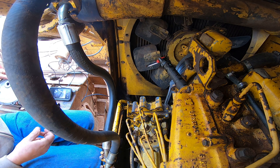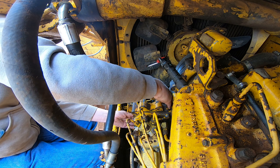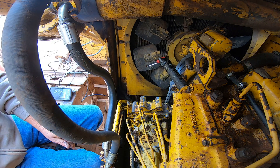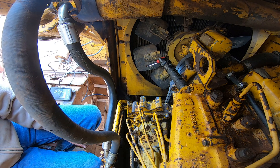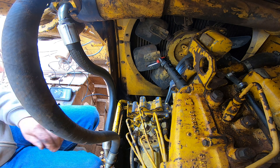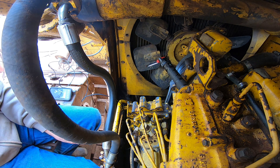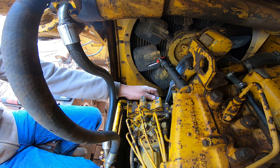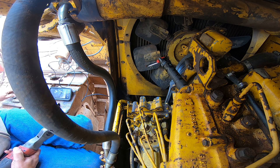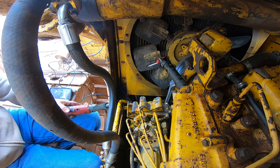It's also not been putting out the amount of power it should. I don't know if it's timing or if it could be time to replace the injector pump. But where we're at today, we're just trying something out. I'm going to put a few bolts in this front cover and tighten it up — it'll be good enough just to test-start it. Usually engines are pretty easy to time; this one has had me baffled a little bit, but I think we've about got her sorted out.